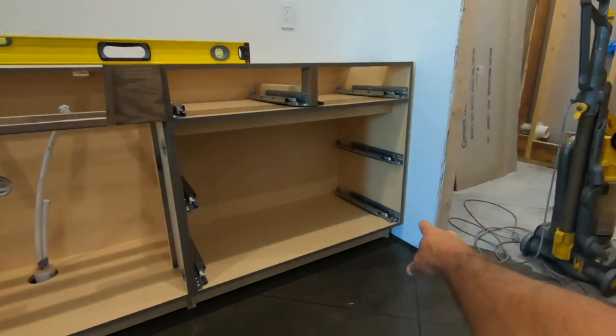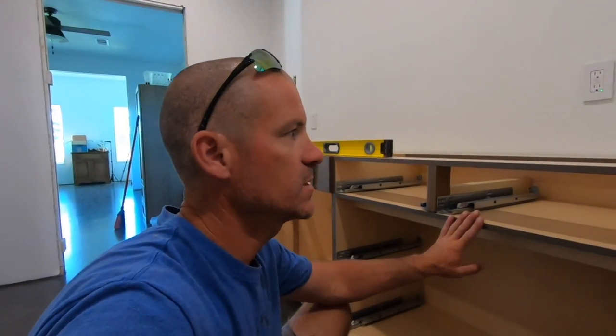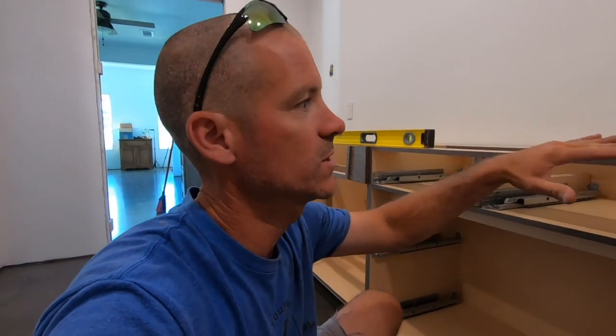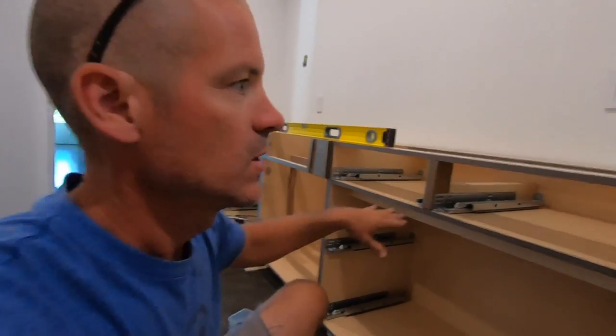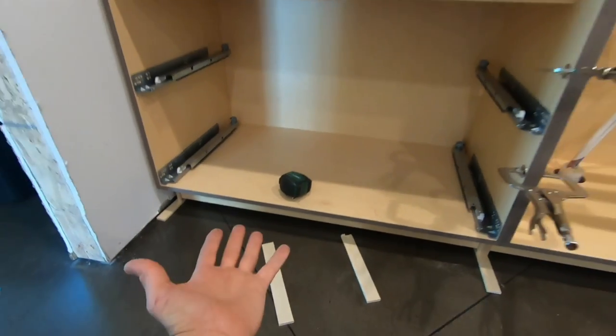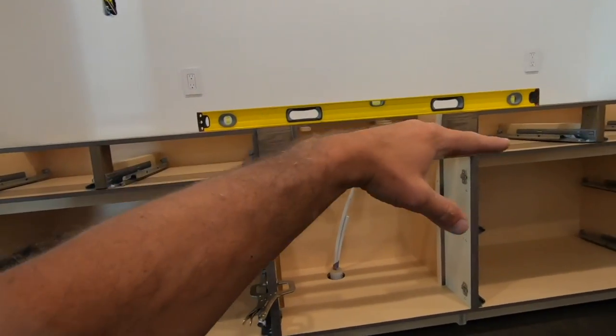Then the important thing is I got to put filler in on each side. And when I first measured my filler, it was a different width at the top than it was at the bottom on both sides, but it was opposite, so I knew it wasn't level. So we leveled this up by putting shims. So I raised this side up, which levels the whole thing.